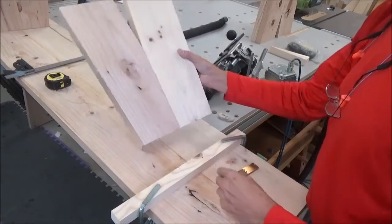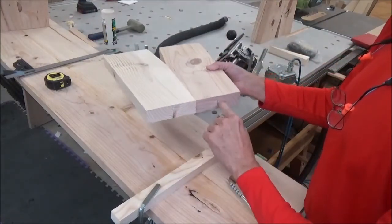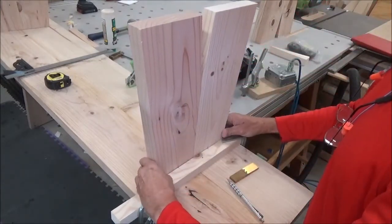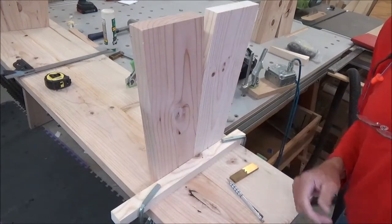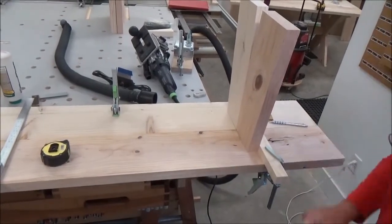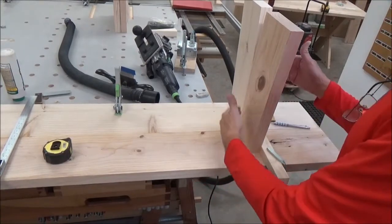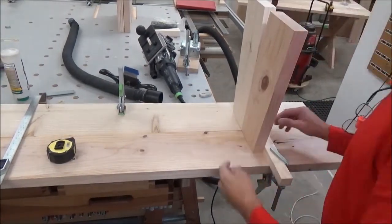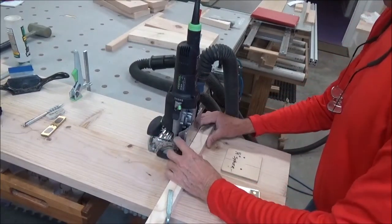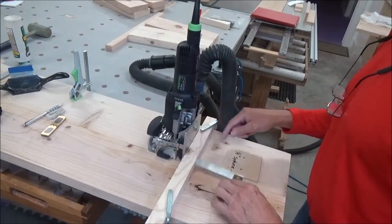So I'll plunge off of this edge — this becomes the bottom — and I'll plunge in this way, and then that should line up perfectly. I'll do that four times. The other thing I want to do when I'm done with that is build a brace to keep this from wobbling. I realized I need my quarter-inch spacer to get the offset I want so that I land in the center of my leg.